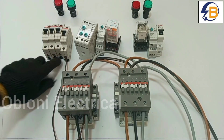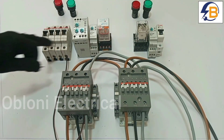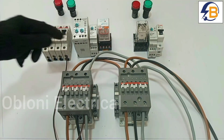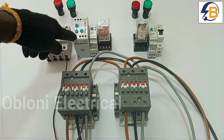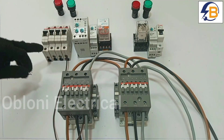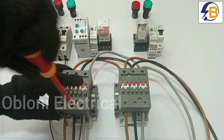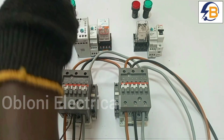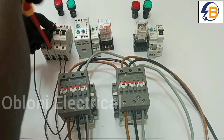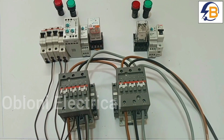I want to clarify: in a situation where we are not using a three-phase phase monitor, we would not need all these breakers. We would only need just one breaker to power the control circuit. But because of the three-phase phase monitor, we have to send three phases and neutral to this device. That is why we use all four breakers — three for live. We take the next connection from the next phase to the second breaker counting from the right-hand side, then the third connection to the third breaker counting from the right.